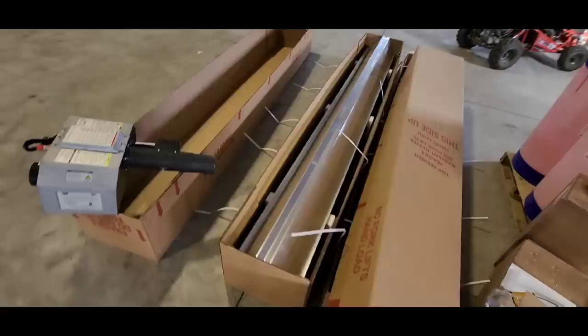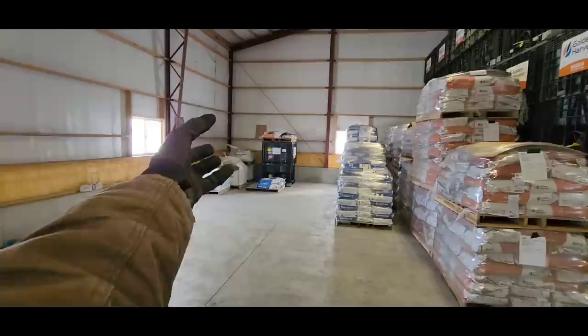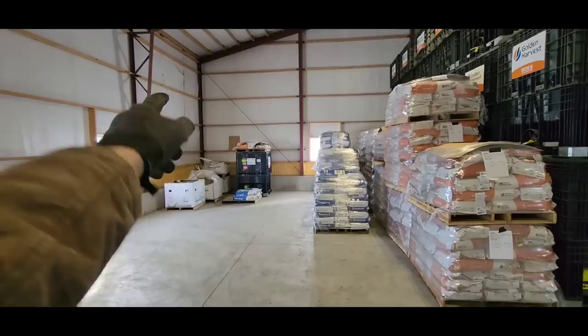So if you're just catching up, I bought this radiant tube heater that we're gonna install in here. We're gonna go right down the peak with it and I'm trying to figure out how to get it installed. Here's my dilemma: my gas line is right outside that corner. That's where my riser is coming from — my tank, that's where we've got to come up. My plan was to come in right there, put the regulator there, and come in, go up, across the top, over, up, and back out to where that burner is gonna mount.